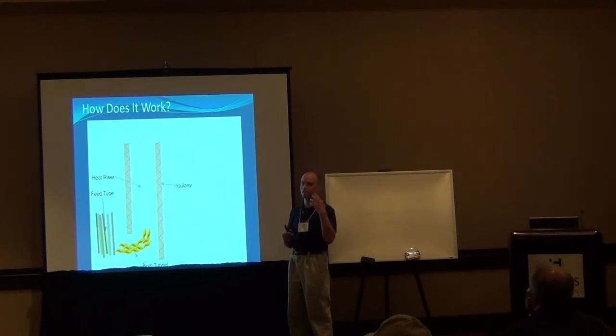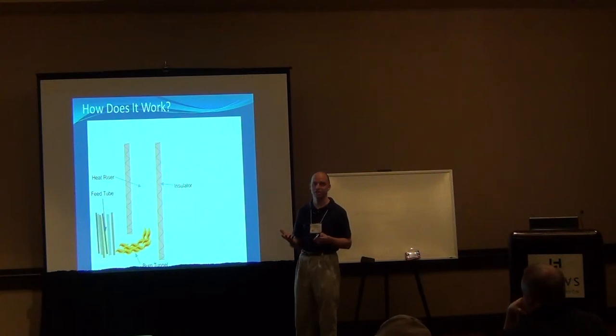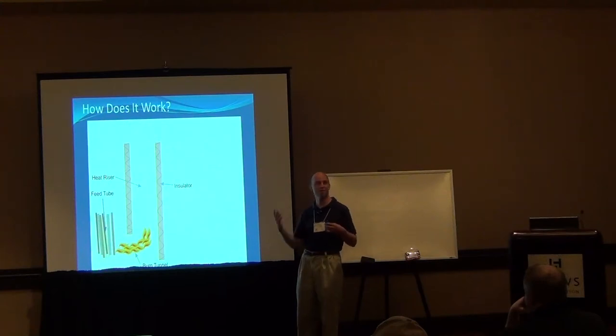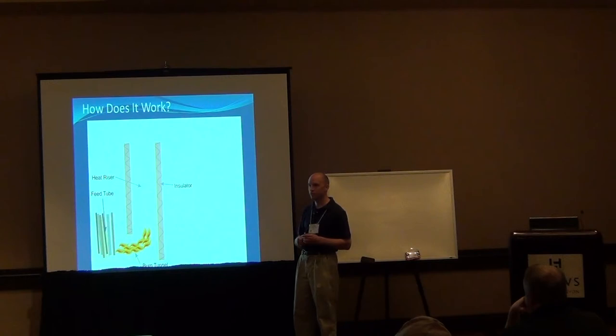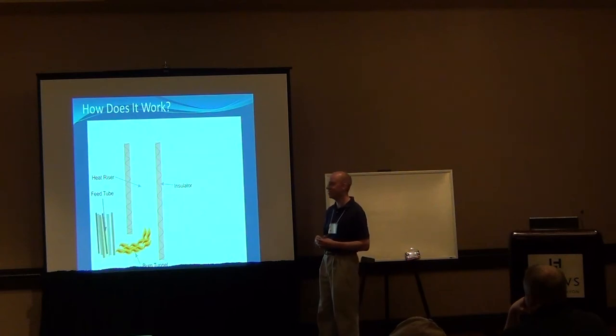I've melted it. If you watch any of my videos — I have a whole series about the rocket mass heater — they go into a lot more detail. You can see some of my successes and failures. My first one used standard galvanized chimney pipe inside, and the whole thing just rotted out. I knew it was going to, but it was a learning experience. Then I switched to a stainless steel heat riser, because we don't have a big source of clay out our way, so it's cheaper to spend a couple hundred bucks on a stainless steel tube than to source clay.